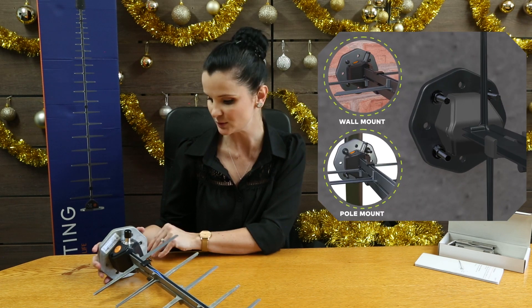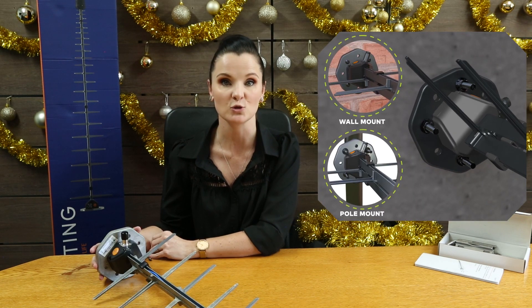Additionally we have the new mounting bracket which can be rotated at 45 degree intervals. If you have two or more of these antennas you can mount them in various MIMO configurations. This antenna is a directional antenna with a max gain of 11 dBi.